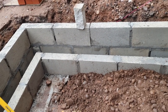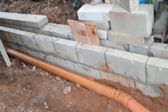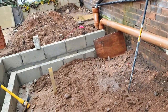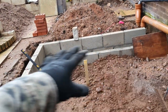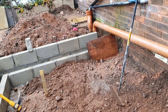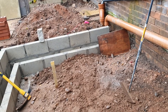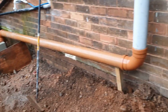I'm just in the process of leveling out the hardcore to cover the bottom of the foundations and get the site leveled off, ready to put some sand blinding on top, then some visqueen, then ultimately some insulation and a concrete floor. But we're one inspection away from that yet.